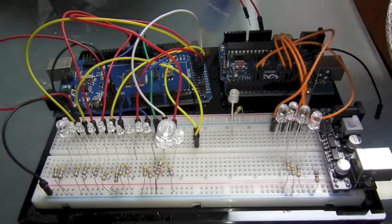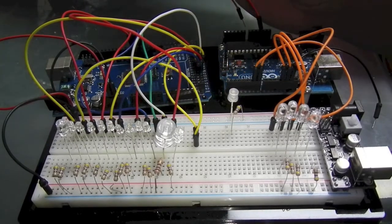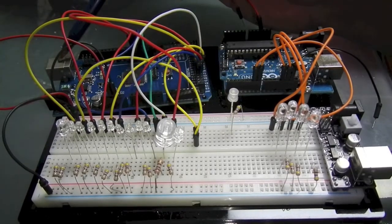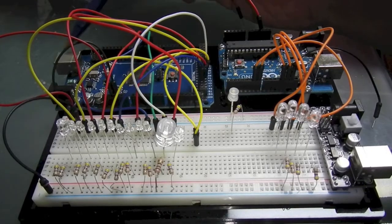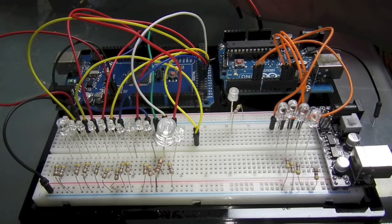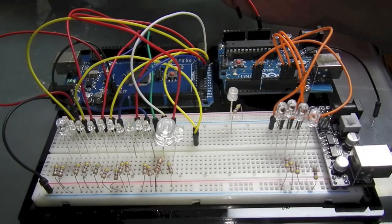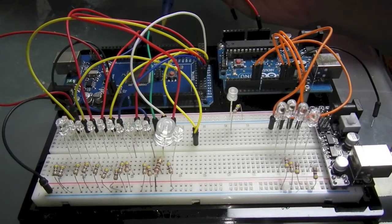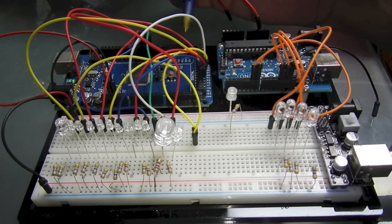The way the Arduino works is you connect it through a USB port to a computer, and that computer can send a program written in C into the Arduino, and that program in C has basically two functions that are important. There is a startup initialization that allows you to set what ports are input and what ports are output, and then there's a loop that continuously gets executed.